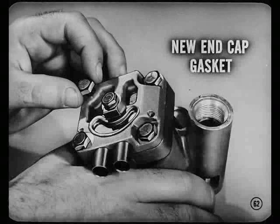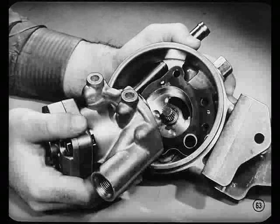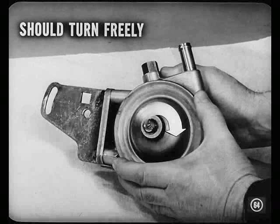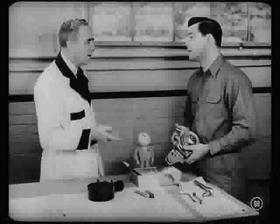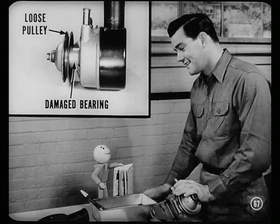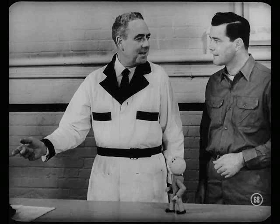Okay. What's next? Next, you remove the parts from the fixture and install the end cap using a new gasket. Tighten the cap screws finger tight to keep the driven block in place. Now you assemble the pump body to the housing. Be sure to use a new body gasket and flow valve seal ring. Next, slip the pulley on the shaft and rotate the pump — it should turn freely without any binding. Once you check that, torque the cap screws evenly to 15 foot-pounds. Recheck the pump shaft again to make sure it doesn't bind. Finally, tighten the pulley cap screw to 20 foot-pounds and finish assembling the pump. That I can do all right, Lee. Are there any other service tips on the pump we haven't covered? In this reference book, Bob, you'll find more service details on the cause and correction of loose pulleys and damaged pump bearings. Well, Tech, I'll be sure to look that information over.